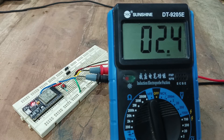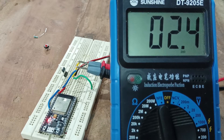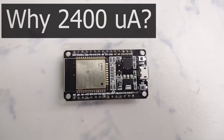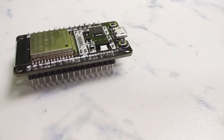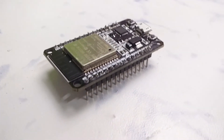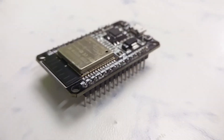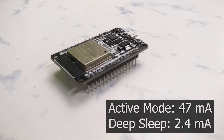In all three tests, we noticed that in deep sleep mode the ESP32 draws around 2.4 milliamps (2400 microamps). However, according to the ESP32 datasheet, it should not draw more than 150 microamps in deep sleep mode — so why is it drawing 16 times more? This is because I am using an ESP32 module which includes other components such as a voltage regulator, onboard power LED, the CP2102 programmer chip, and other passive components drawing extra current. Despite this, even as a module, it consumes about 20 times less current than in active mode.